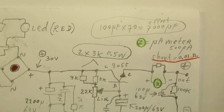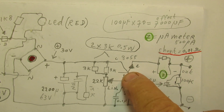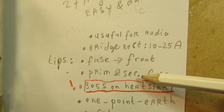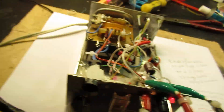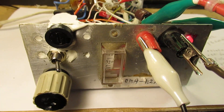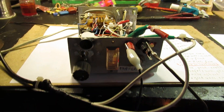The 2N3055 is the transistor that does the job — it can get very hot, so a heatsink is necessary. Mount the 2N3055 on a heatsink. Use primary and secondary fuses, and when mounting fuses it's a good idea to put the secondary fuse on the front panel so you can easily change it when the current gets too high and the fuse burns out.